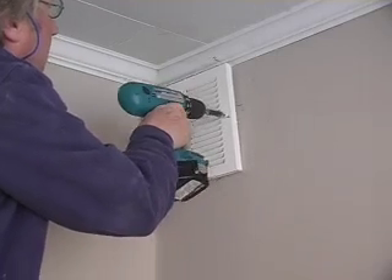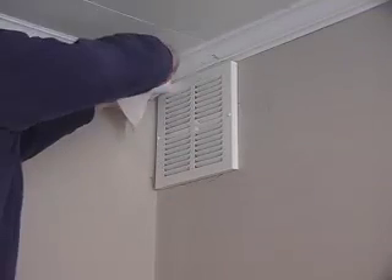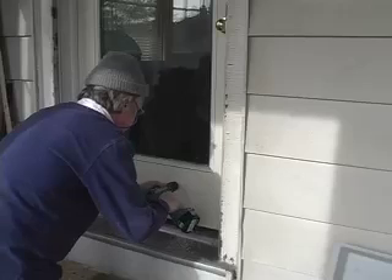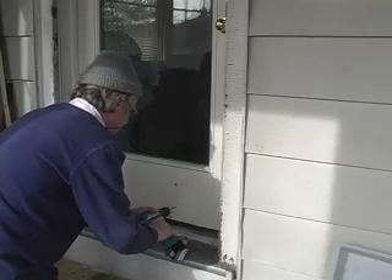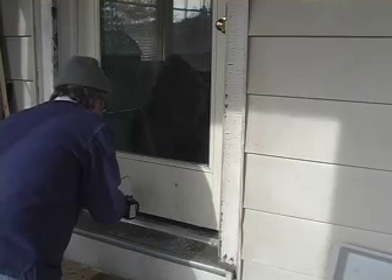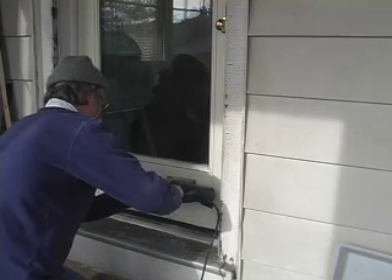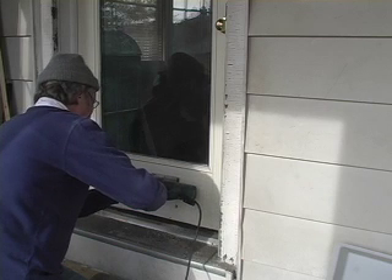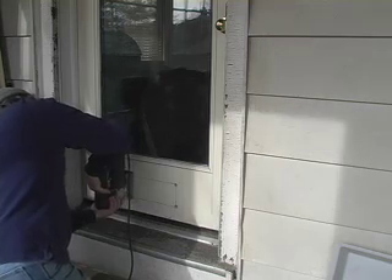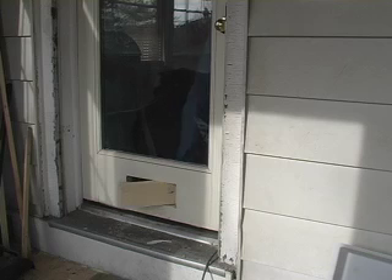That's 80 degree air — look, you can see it coming in. 80 degree air coming in for about six or seven hours a day into your house. Now if you suck air out of a space you've got to bring air into it, and we don't want the air coming in from outside because that's cold, so we have to put a return air vent in the door. You can put it in the wall too and you could use a dryer vent opening to do that if you wanted. Here's me using the high-tech kicking method to get that out of there.